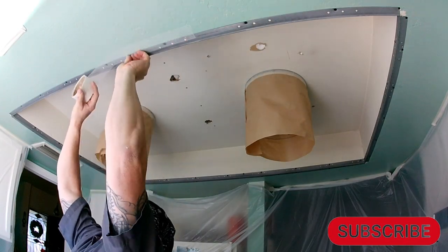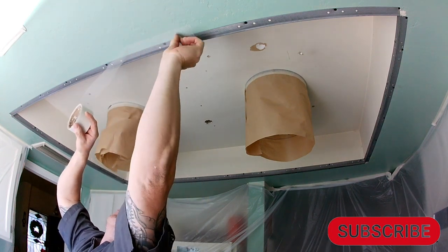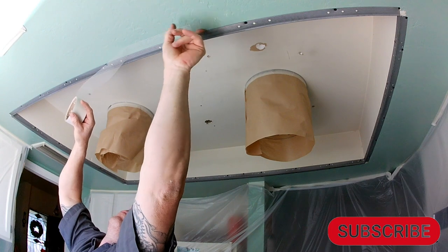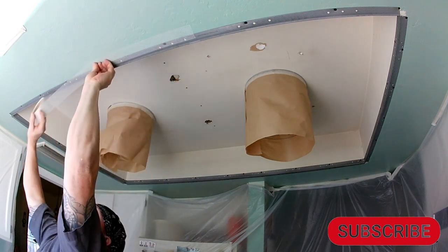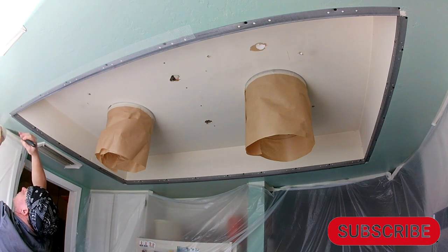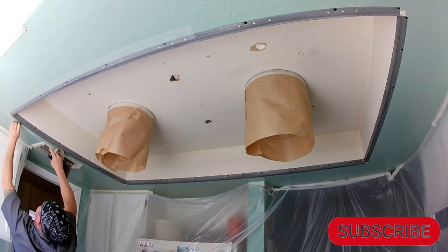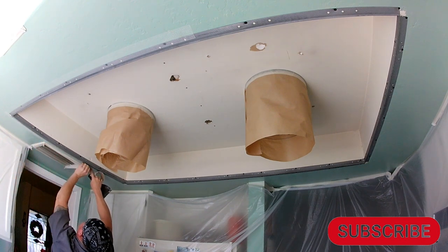Well, let's go ahead and get this fiberglass. You can go ahead and put the fiberglass on like that. It bonds pretty well. I'm not going over it. I'm just going right over the flange. It's taping the corner bead right to the little sheetrock and follow through all the way. Cut it with my knife. Keep going.